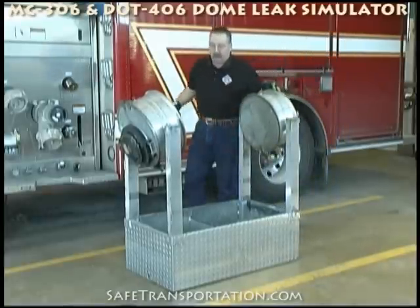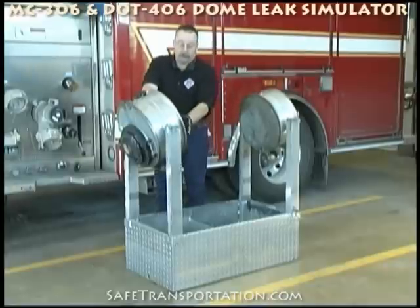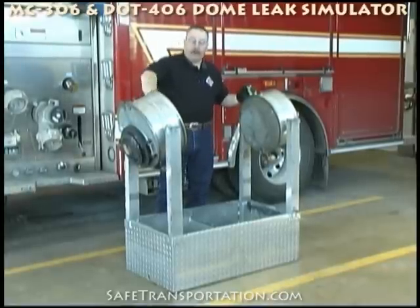Now that we've got both pieces locked in place, what you'll want to do is you'll need to have a 9/16 wrench and a 9/16 socket to disassemble the plate for the 3-inch clean-out cap. We have to reverse this plate.